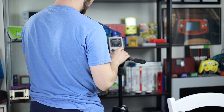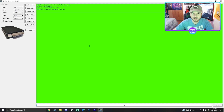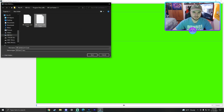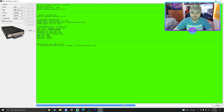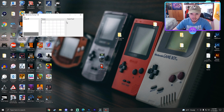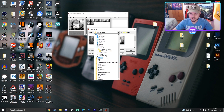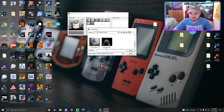Once we've taken our red, green, and blue photos we can hand it off to other Jake who is at the computer right now. First thing we're going to do is open up GB Cart Flasher, because that's the software I use with the Flash Boy. We're going to start with Cart Info and yep, it is reading the Game Boy Camera. We're going to look at the ROM size, change the flash to 1024 kilobytes because that is one megabyte, and then take the RAM up to 128 kilobytes. Now we're going to read the RAM and name it GB Camera Save 3. We're going to go into GB Camera Dump, hit File, Load Save ROM, and open GB Camera Save 3. We're going to save the current picture — I'd find a different folder because for some reason if you put it in the Cart Flasher folder it doesn't want to work. I have a folder just for GB Camera Photos so we'll just do this again.